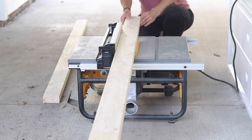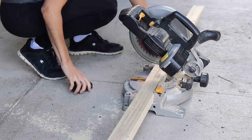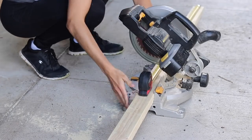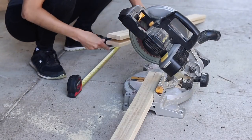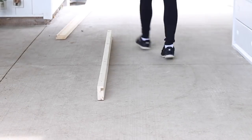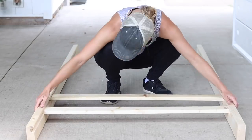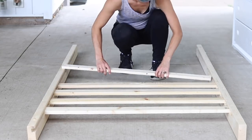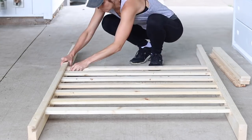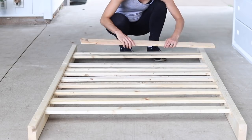This is the box that holds all the weight, so I wanted the furring strips to be supported by wood. I made a groove that was about 3/4 inches wide and 5/8 inches deep. Once my two 2x4s had grooves cut into them, I started by cutting out pieces of my furring strips to go across and support the mattress. These are basically 1x3s, and they're pine. I measured them to a little over 39.5 inches. I wanted about a half an inch of extra board to go on top of the 5/8 inch deep grooves I cut in the 2x4s — they're going to sit inside there. And I wanted the measurement between the 2x4s to be 38.5 inches, which is the measurement of my twin mattress. I spaced the 1x3 furring strips evenly across the whole thing — I cut 11 of these, so they were about every 6.5 inches.